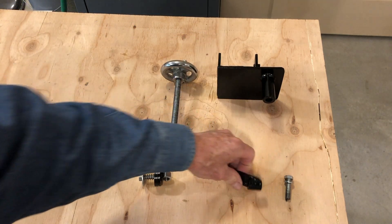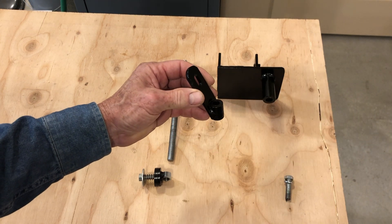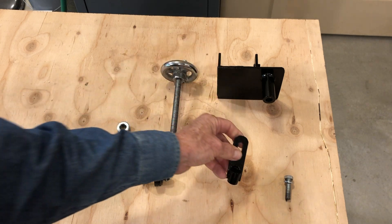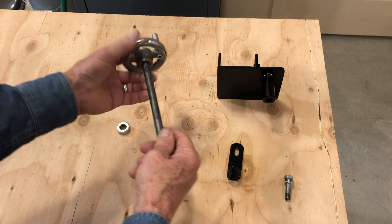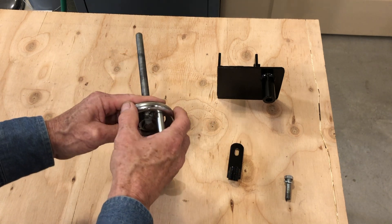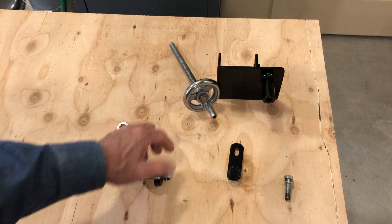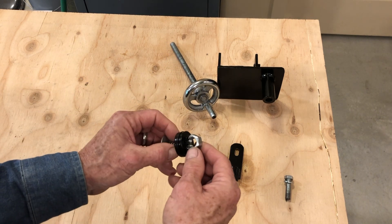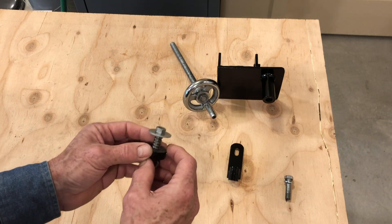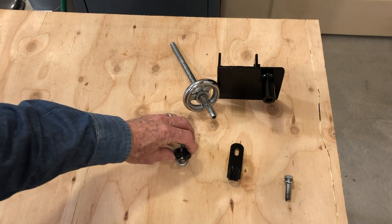This is a little arm that I will use — I will place one of my handles on the drill press that feeds the head and install this. This is a worm shaft, or just a threaded shaft with a hand wheel on it, and we'll use that to move this arm back and forth. And this is just a trunnion — it's just a nut welded onto some discs with a stud coming out of it. And these pieces make up my little milling feed attachment.